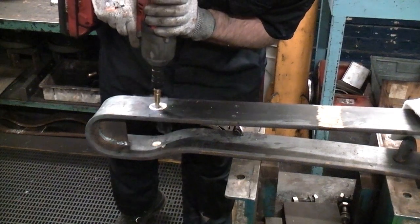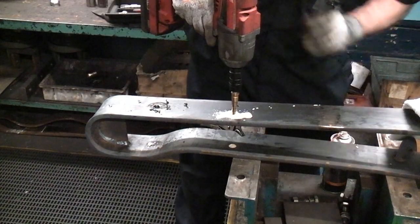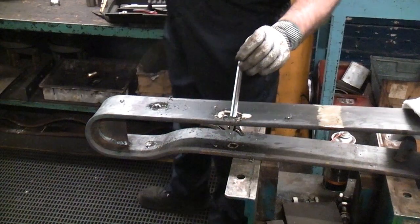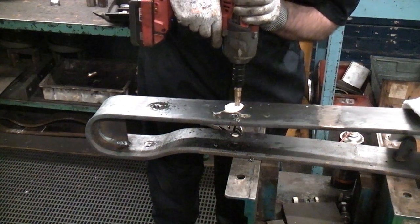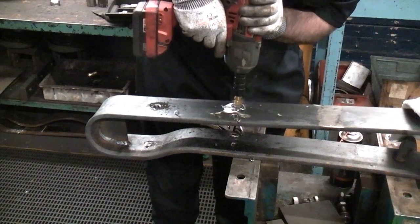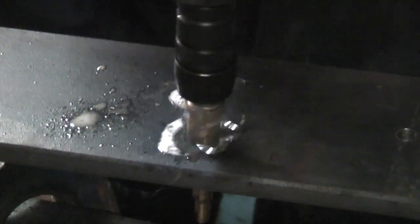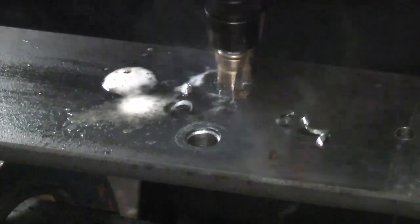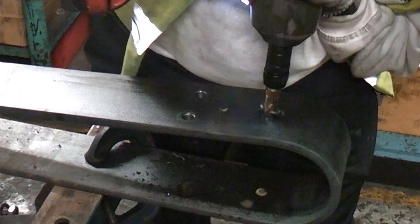You might be thinking that these are expensive and for a DIYer they are, but for professionals these work out very inexpensive. Take for example this spring steel bumper — this needs six 14mm holes drilling in it. I have already drilled an 8mm hole using a cobalt drill bit; the bumper is made from 12mm thick spring steel. To get these drilled by an engineering firm you will probably be looking at 10 pounds per hole. Even if you did them in-house you'd have the time of setting up the drill press. With these drill bits you can easily drill the holes in a matter of seconds, quickly and with no effort. And as you can see even the apprentice loves them.